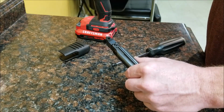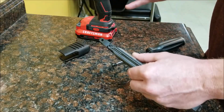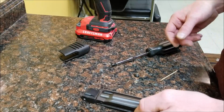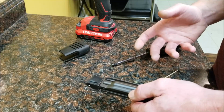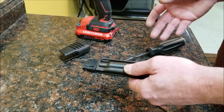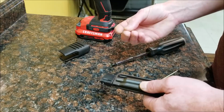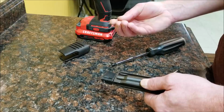So I haven't had any problem with the Viton seals as far as low temperatures or anything like that. And that's what I plan on using to do the test, to see if you could store one of these charged for long periods of time, because it will not work with the cast urethane seals. Other than that, the cast urethane seals work absolutely wonderful.